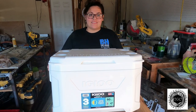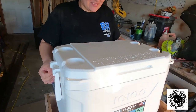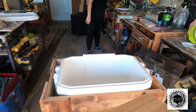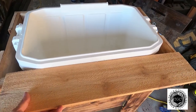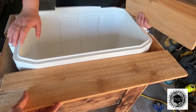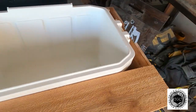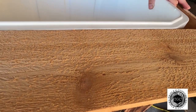Now what we're going to do is put the cooler in to get the base. Using the same wood, put it up here and push it down. You're going to have to cut off these sides with the grinder. You want to get it flush right there, and then the same thing on the back. Once it's flush all the way around on both sides, grab a 2x4 and cut it — the dimensions are 14 and five-eighths. We come from the bottom, throw it up there, and use a mallet to hit it in and get it flushed with the bottom part.